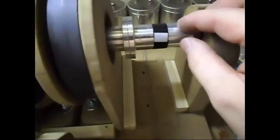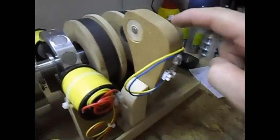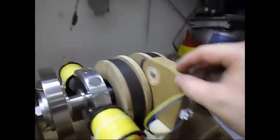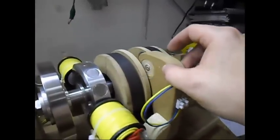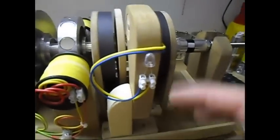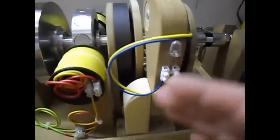I have here a black tape and a piece of reflective tape to measure the RPM. And I have here just a test coil holder — there's a coil in there so I can move it around and put it in place or not. And I have here a large LED. This one is rated 3 volts at around 20 to 30 milliamps.